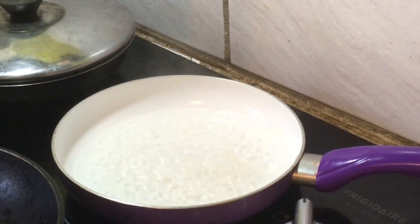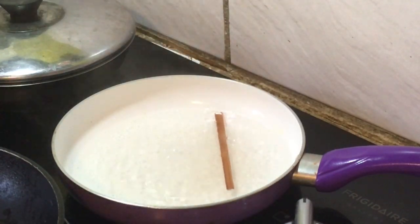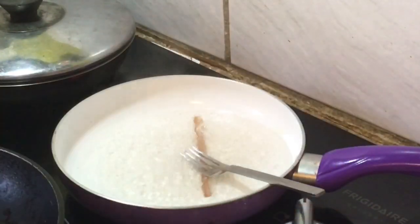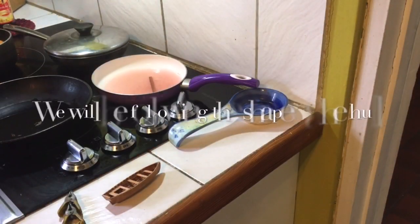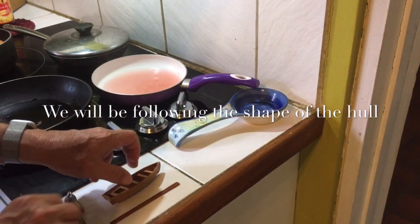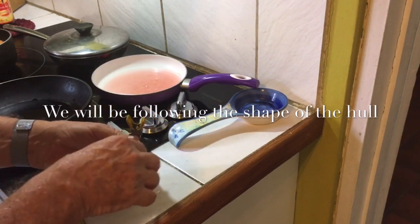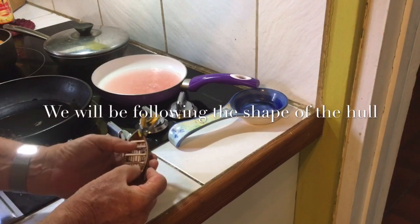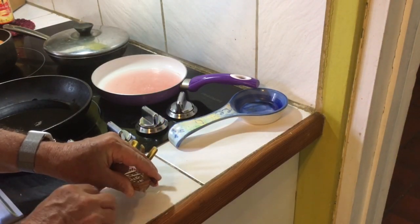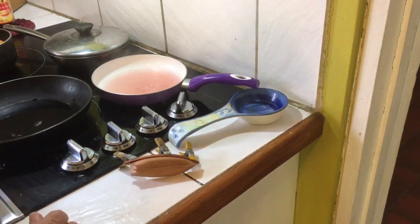To make the capping rail, we're going to put this piece of mahogany in and then bend it on. So we'll put it in for 5 minutes, just like we've done with all the other pieces. So now we take that out. Interesting to see the pink mahogany discoloring the water. And so we just follow the hull. And we just leave that to dry.